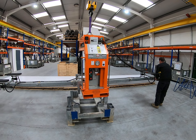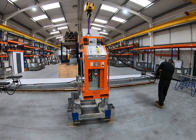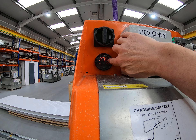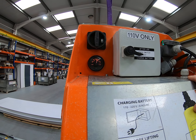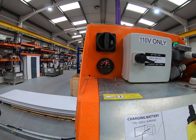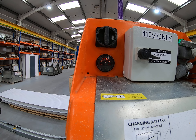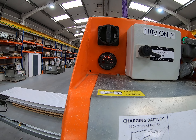Don't worry about the sound of the vacuum pump running — it's the red light and the audible warning you need to be concerned about. With the machine switched on, the voltmeter is now illuminated and you can see it's sitting at just around 26 volts, indicating quite a healthy battery. As I explained, don't expect it to go any higher than that; as you work with the machine throughout the day it will gradually work down the scale slightly to 24 or just below 24 volts.